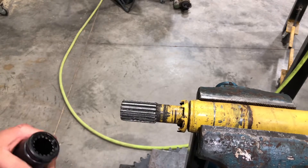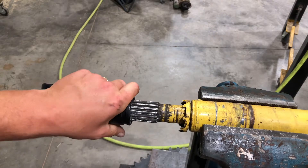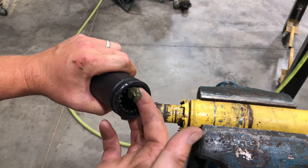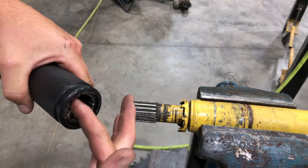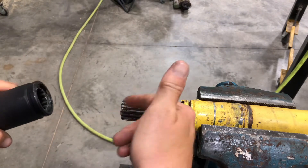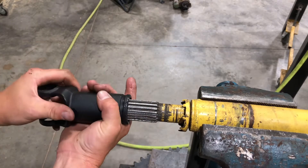I got really close — it'll come on. I'm going to put a little bit of grease on the inside of this, and that'll give me an idea where all my high and low spots are so I can knock them down. Because this shaft went flying around, it could be egg-shaped or anything, so we're just going to try that.